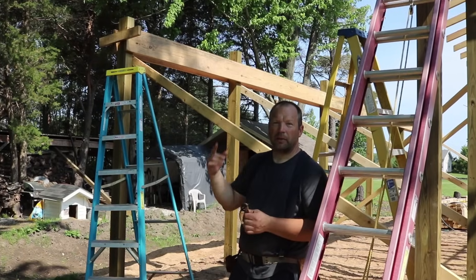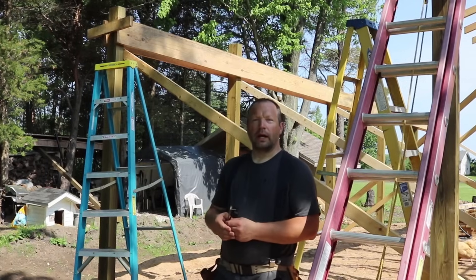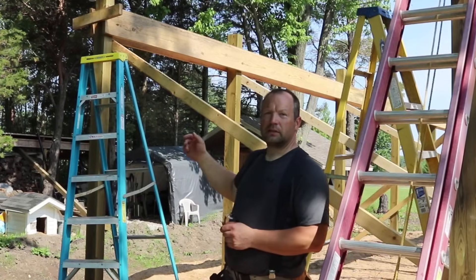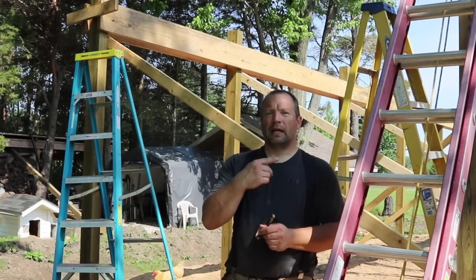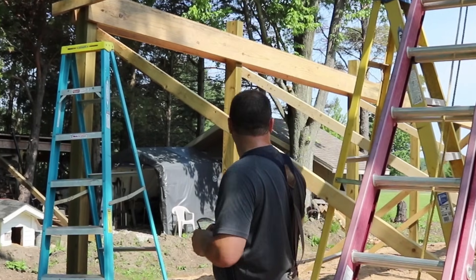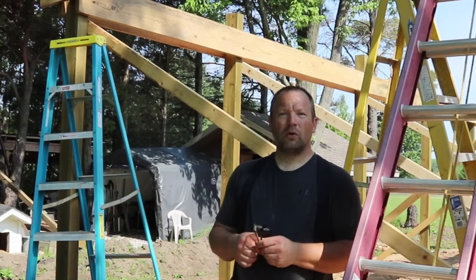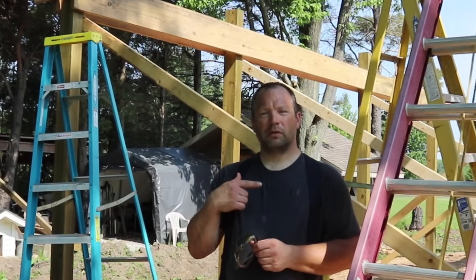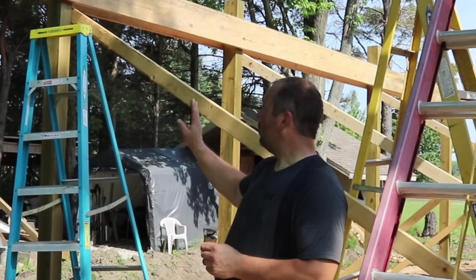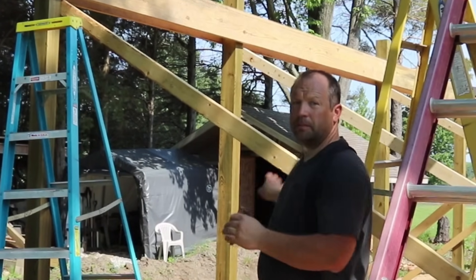This was just me explaining how the one end for the rafters for my lean-to are basically framed the same way as the posts and header system for a pole barn. I got my 4x6 posts with a 2x12 header, and then I plumbed them up and braced them so they're all perfectly lined up. Then I'll get started by laying out my first rafter, cut that rafter, and use that as a template for the rest of my rafters.